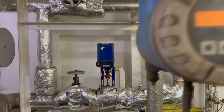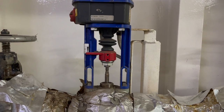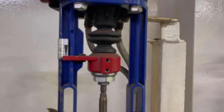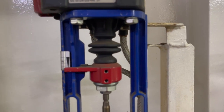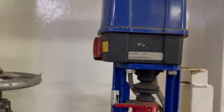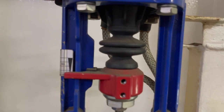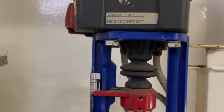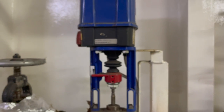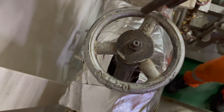Now I am in the purifier room. This is the viscosity temperature controller — it opens or closes the steam inlet valve in order to maintain the required viscosity, which is set at 13 cSt for HSFO. The regulator knob is moving, trying to open more steam to bring the viscosity down, because once MGO starts to come in, the viscosity will drop suddenly.